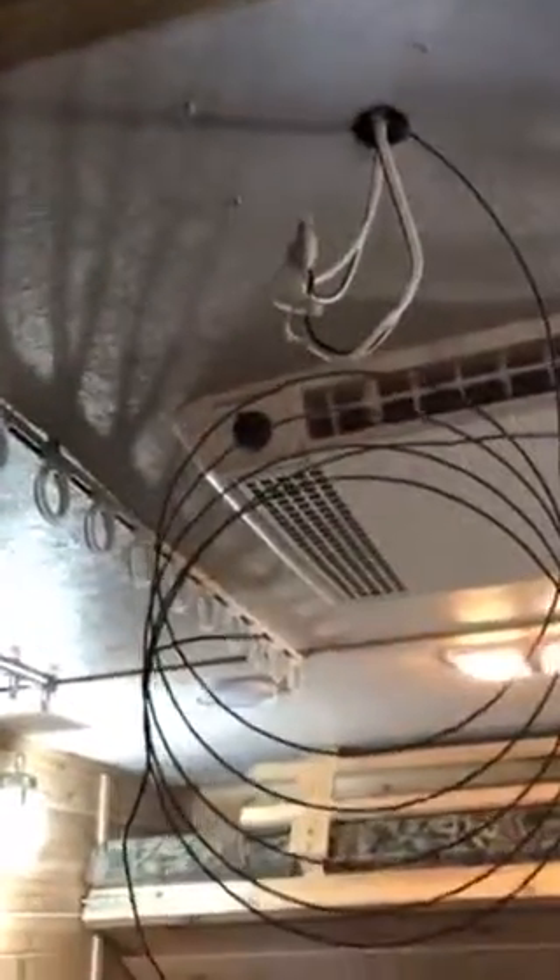To gain access I took the light out over here — you can see my bailing wire hanging there that I ran through. I drilled a hole with a three-quarter inch long drill through the stud at an angle toward where I wanted to be, keeping it really low on the stud because the insulation is kind of high in there, so if you keep it real low you won't hit too much insulation.